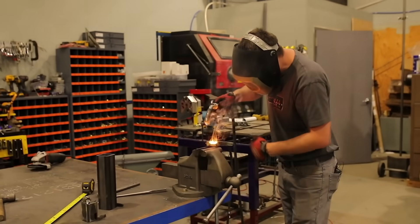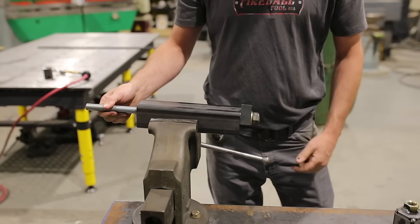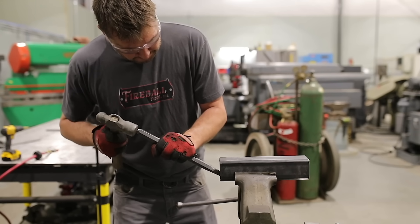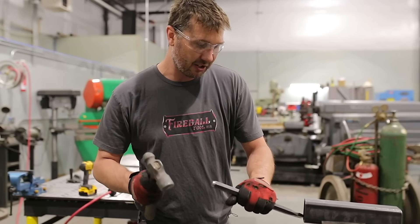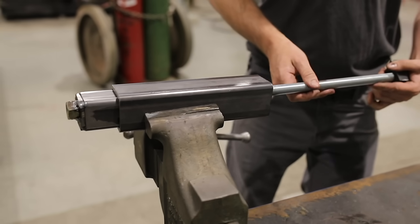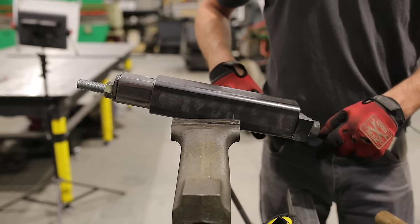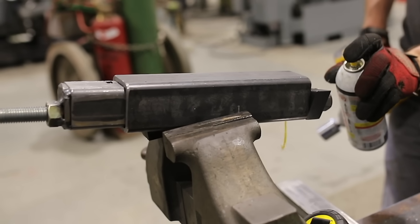To start the assembly, you just need a stop on the back to cap it — something to block it because we're going to be pulling on the edge of the tube. I like to put a washer on the end because there's going to be quite a bit of friction there. Give yourself a little bit of a starting point by chiseling out a good inch or so. If you squeeze too hard on the vise you're going to pinch the slug, and if you put a little bit of an angle, your chips will roll out so they don't get bound up. A little shot of lube and here we go.